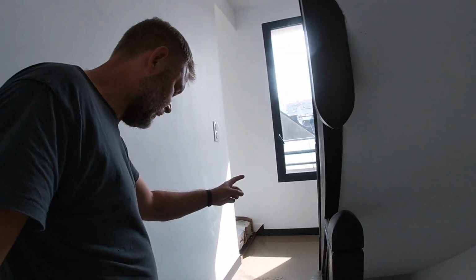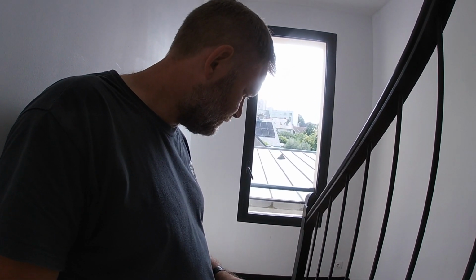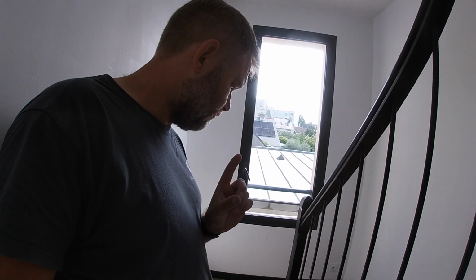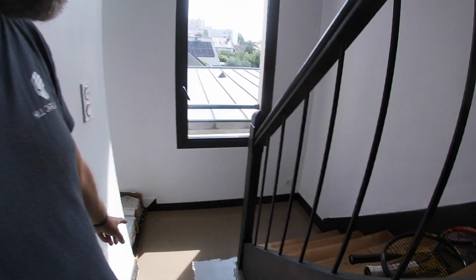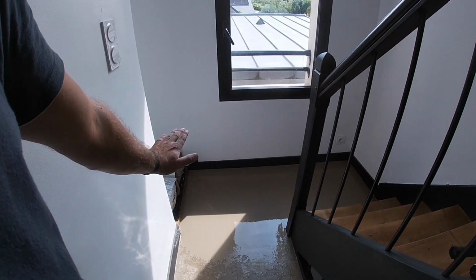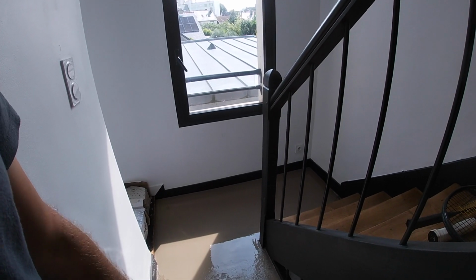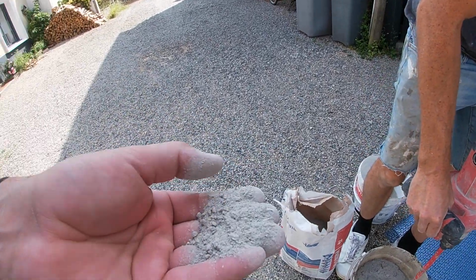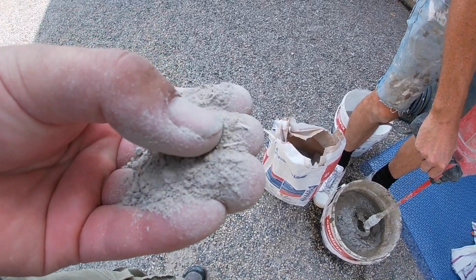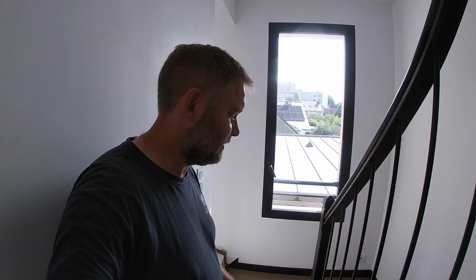Okay, so that's the second phase done. First was the primer, well, cleaning and primer. Second phase is just to fill in that corner, because it dipped down really about 20 mil to that corner. So make it reasonably level with self-leveling with the fibre stuff. You could see that in the powder mix there was little fibre bits, and that helps with the flexibility of the leveling.